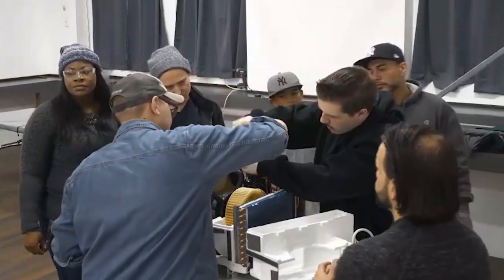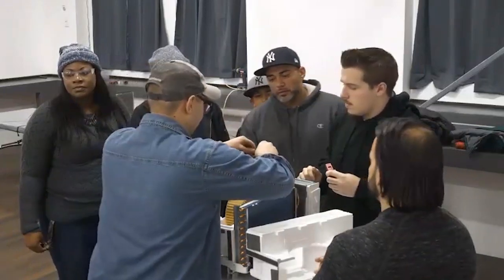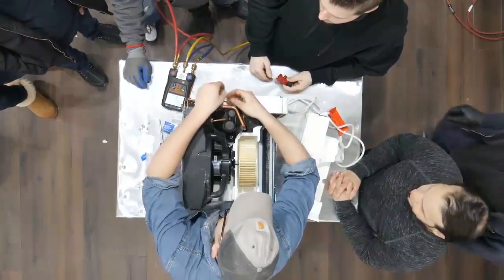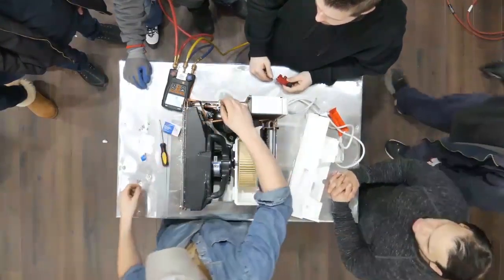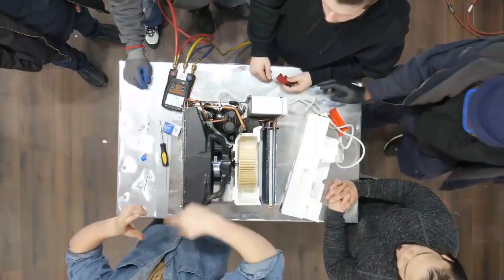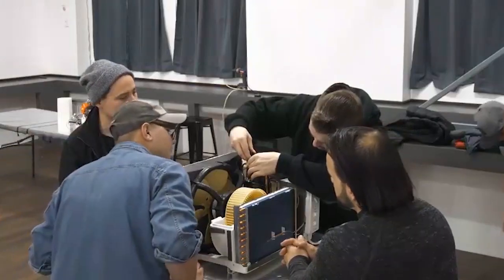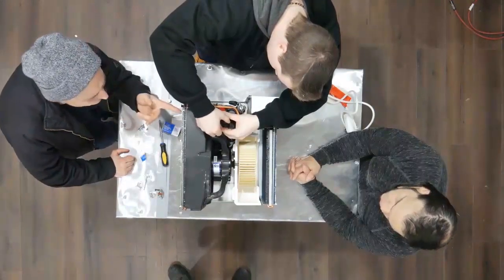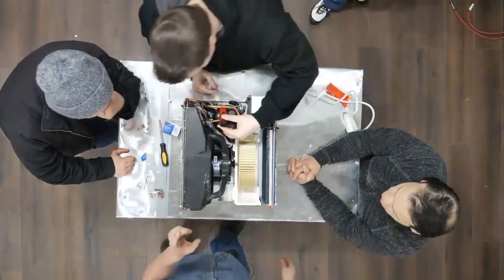This might be in your way for spinning, so maybe we'll take this off first. It's good to go all the way around so you don't have a burr when you take it off. A burr would be like an uneven cut — when you go back and forth, if you don't go all the way around the pipe, make sure the pipe is on those two rollers in between the two rollers. We're cutting the pipe because we're going to put a T in.